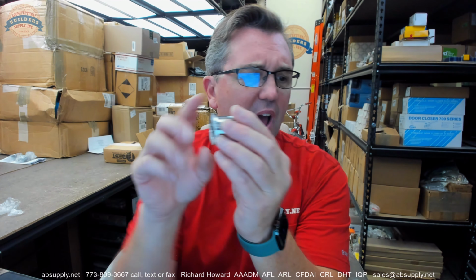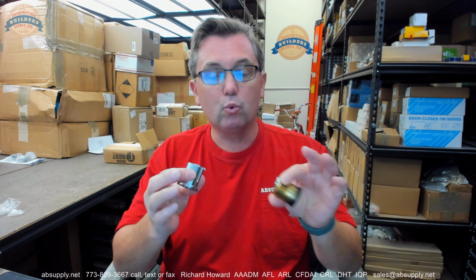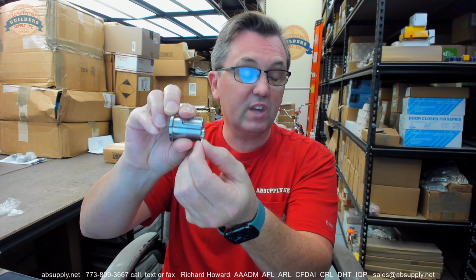And his answer is, the back of the flanged end of the mortise cylinder to the back of the cam is the dimension that you need for door thickness calculations. For example, to check that the cam reached the middle of the mortise lock, or that 2 mortise cylinders don't bump into each other in double cylinder applications, is why you want to know that. Basically what he's saying is, if you don't know that length, you can still calculate it, but you still need to know the thickness of the mortise cam.